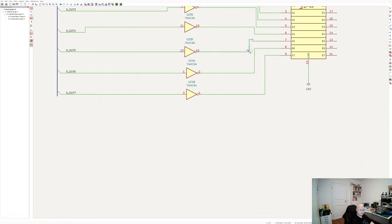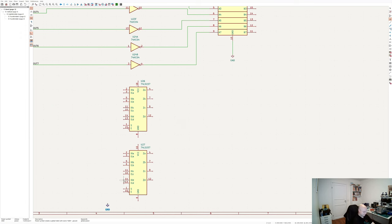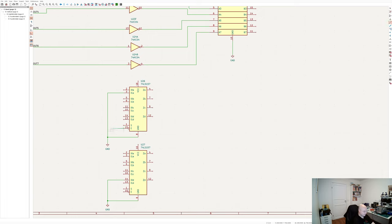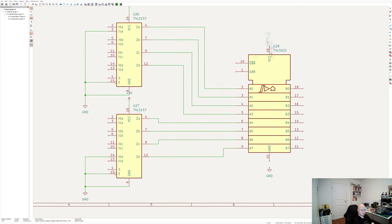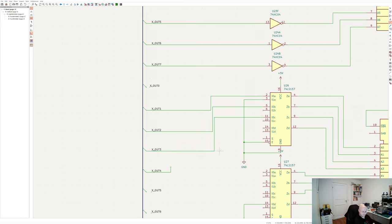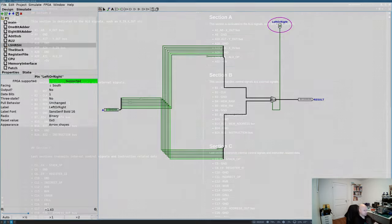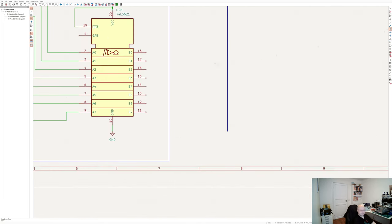Finally, I have shifts, and as I mentioned, shift is just a multiplexer whose inputs are connected with the data shifted to the left or to the right. I'm using 4-bit multiplexers — technically four 2-bit multiplexers, but they act exactly the same. I need to connect them to the X bus since shift is also a unary operation, connecting both left and right inputs to the X bus with the proper shift. I had to reconnect everything after making a mistake, removing and reconnecting the connections. The output of those multiplexers goes to the output buffer with an open drain connector.